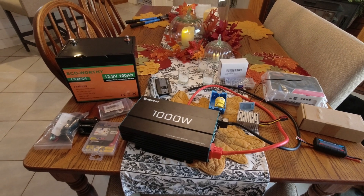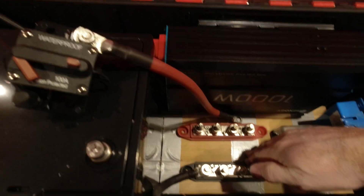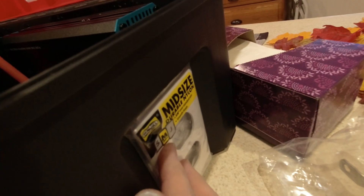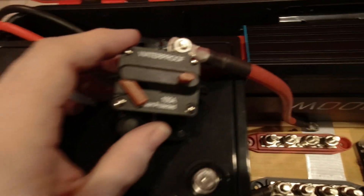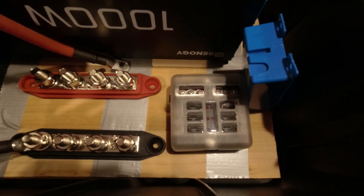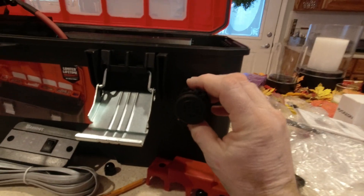I want to give you a quick rundown of the layout. We've got our battery up here; we put a piece of wood in the bottom to hold the battery in place. I'm going to attach the inverter to the side and hardwire it to an outlet on the side right here. We've got our fuse box down there and terminal blocks going up. We're going to use a 100-amp circuit breaker — positive going to this side, the other positive going down to the terminal block, and then we have our negative right here. We'll wire our DC circuits and put our outlets coming out right there.